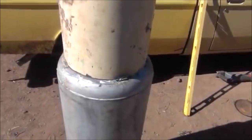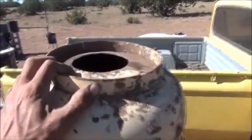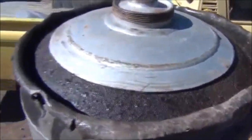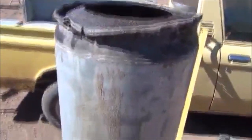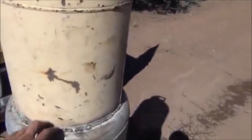I wanted to show you where we are — not far from where I showed you before. The only difference is I've tack-welded and ground it and put the four-inch hole here in the top. Let me show you what we've got going on here for a lid to fill with our material. As you can see, it's actually the disc cut out of the other side — I made sure it was larger than the hole we cut here. That's where we're going to fill our material into the reactor; it's going to go all the way down and burn down at the very bottom. These welds have been fully completed all the way around, making sure that's nice and sealed with no air leaks between the two.